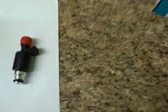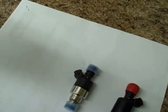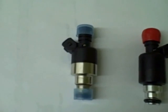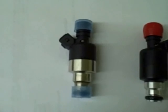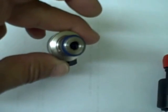Here's our standard FJ-47, okay? We've got a whole bunch of them in stock always. This is what they look like from Standard Motor Products, and if you go to their online catalog, this is what they look like. They're a stainless steel base, they have a three-hole discharge. They're a Lucas-type disc injector. We sell a ton of these — they're very good, we have no problems with them.